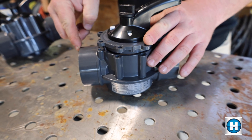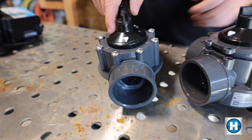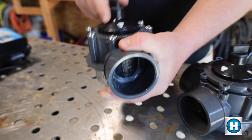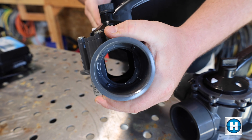Now with the two-way valve — these work in the same way. You can see the inside: the flapper is closing off water flow in that direction. And then if we open it up, we've opened up the valve, so now that's allowing water to pass through.